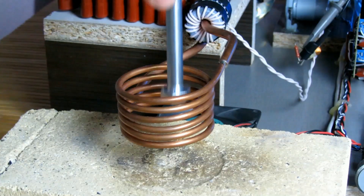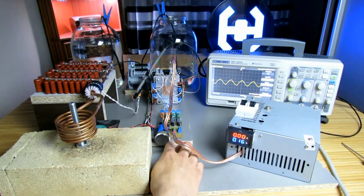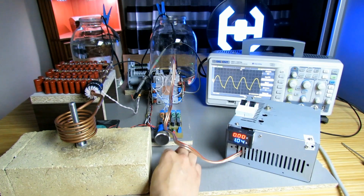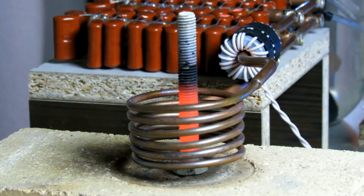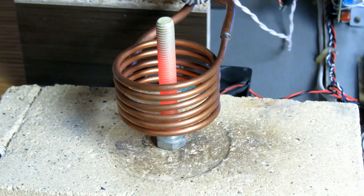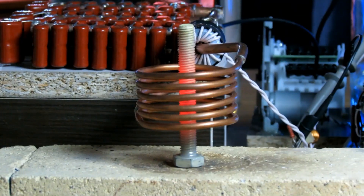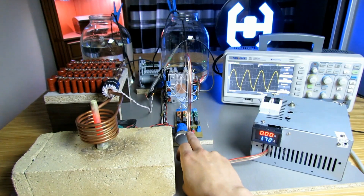We test the inverter power on a steel bolt with a diameter of 12 millimeters. We turn on the first switch to charge the capacitors, then turn on the second switch which supplies the bridge. We reduce the frequency on the master oscillator and observe the current growing. At one ampere of consumption we stop adjusting and leave the system to run for half an hour while monitoring temperatures wherever possible. The iron workpiece heats up to redness. If nothing explodes in half an hour and the city doesn't lose power, we can raise the current to two amperes.